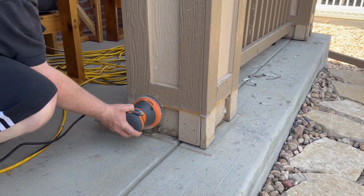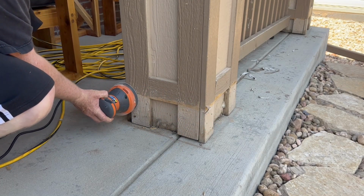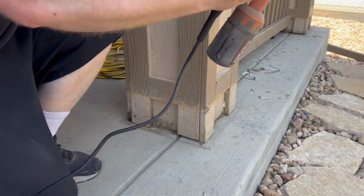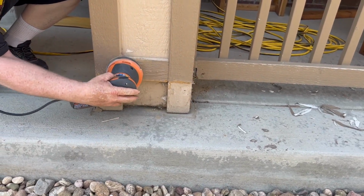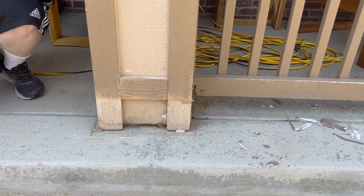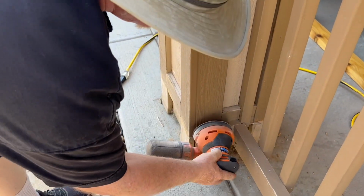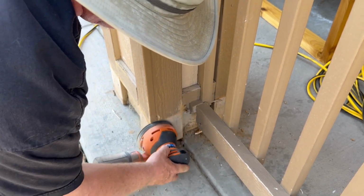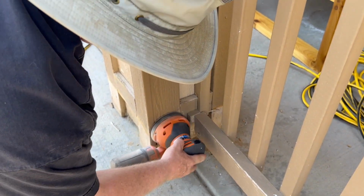We came in with the sander, just peeling off the caulk. We actually sanded for a while on the bottom of these boards. Thought we could sand them down till they were straight. And I knew we were taking the front face off that MDF trim, but you know, the new trim isn't gonna lay flat if it's sitting against a swelled out piece of trim. So after we took off the caulk, we went around and sanded down the bottom of those so that they were up and down, vertical. That way when we put the new trim on, it would sit straight up and down. Some pieces we got a little better than others, but we gave it the old college try.